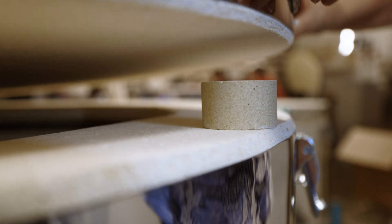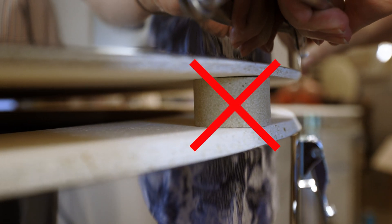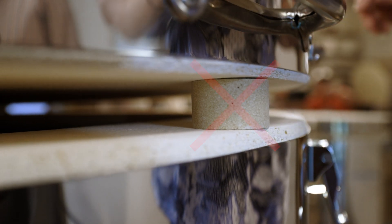Actions to speed up cooling will damage your kiln in the long term. For example, if you use a small support clamped between the kiln lid and the top layer of bricks to vent the kiln prematurely, or open the lid too early, too much cold air penetrates the kiln too quickly and interrupts the slow cooling of the heating elements and lightweight fire bricks. This can result in early wear. The heating elements lose their elasticity, become prematurely brittle and can therefore break more easily. The lightweight fire bricks can crack, which affects their insulation performance.